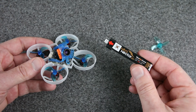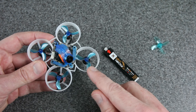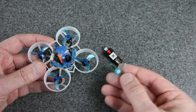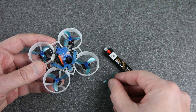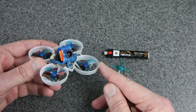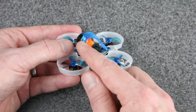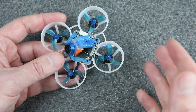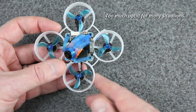Right now I'm getting about three minutes of flight time on a 300mAh battery. I've tried three-blade Aussie props — they work great, although I had to drill them out to fit. I also tried four-blade Gemfan props, and I think I like those better for this particular motor because it's 19,000 KV, which I feel is actually on the low end for this build for racing. 20,000 or 22,000 KV might give it a little more oomph. I'm holding the camera with a 3D-printed canopy, and I'll put an STL file link down in the video description, along with links to all these parts.